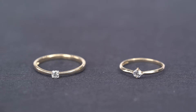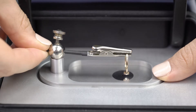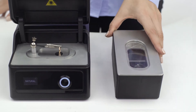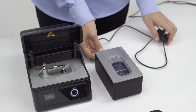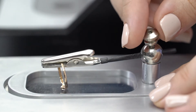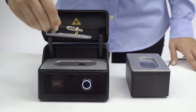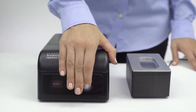Let's take one more ring — we can see small diamonds here. By eye, it is very difficult to position them to cover the target hole. For such cases, we have provided an additional device: a video holder. Let's switch on the video holder and wait for its display to show the imaging from the video camera. We can see a mark on the display. Now let's put the ring into the video holder so that the diamond table center is on the mark, fix the ring in this position, then reposition the upper part of the video holder into the device and measure the diamond.